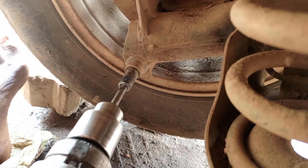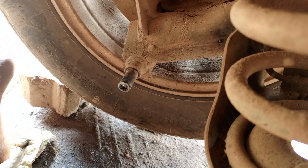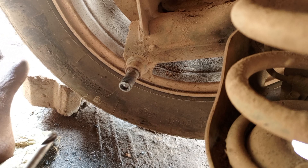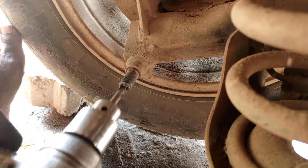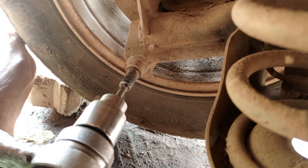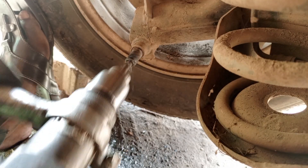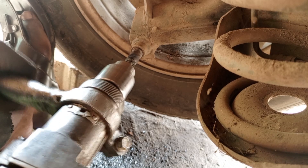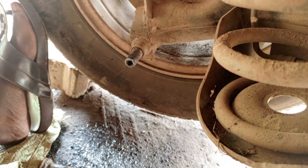You have to check that you are not bending — the bit must not be drilling into the remaining thread walls. You have to be more accurate and stay in a straight line. Now we have passed through — we have passed through the broken bolt. Now it's time for removing this bolt, so let me show you the trick.